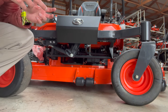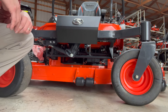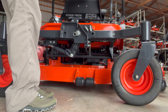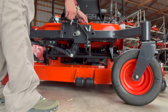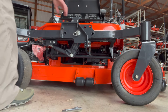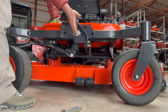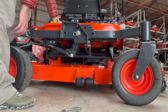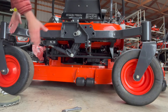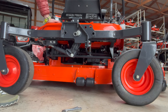So we're going to show you how to jack up the front end of these ZDs. Both of them are the same — the 12-11 and the 16-11. We're going to do it on the 12-11 here. We've got two pins here and we need to pull both of these. You do need to make sure that your tires are perpendicular to the machine — not straight forward like they typically would be. Easiest way is to give them a couple kicks so they're going in that direction, because the whole axle is going to pivot on this tire. We need to make sure it's going in the right direction so we're not trying to fight that while we go.